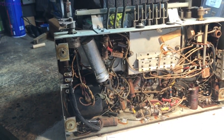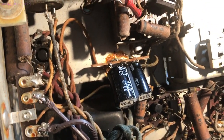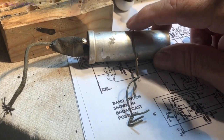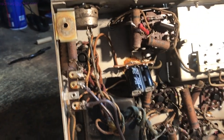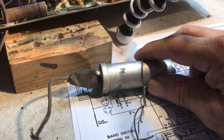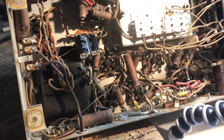We got the power cord changed out and the electrolytic capacitors changed over, put on a terminal strip and linked in with the original wiring to the can. One thing I noticed about this can — I was wondering what that band was on it. It looked like regular wire but it's baling wire. They had baling wire in there to the chassis, and I'm surprised it wasn't shorting to anything. I didn't realize that until I clipped it and pulled it out.